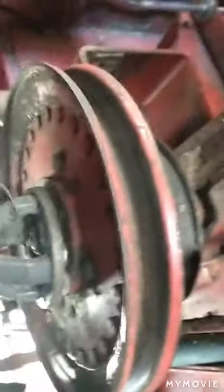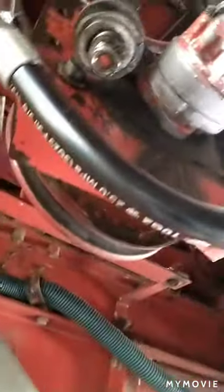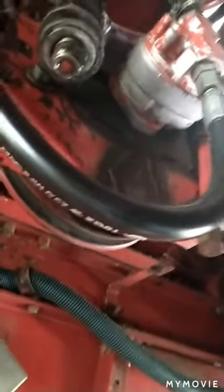Next thing on this end here - pull those four bolts out of here. There are four bolts that go in there, just pull those out and you can pull this plate with a little pilot pump. Pull the whole plate back once I get that belt on, because I've got to use both hands again, and I'll be able to show putting those bolts back in and tightening down the pulley.